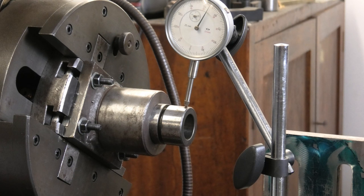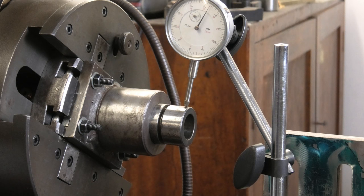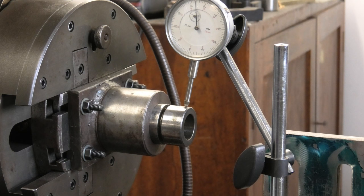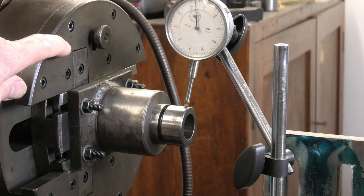Okay guys, this is round one — over and done with — and I have lost substantially. I can't find where it's out. Everything has to go one way: you can't change the two plates around, the slide can only go one way, the feed screw can only go one way, the snout bar holder is keyed only on one side. I've checked that the little drive dogs aren't jamming up in the drive slots, and there's no light between the mating surfaces. And this is what I've got. It's not out lengthwise in the slot — it's out that way. So I'm going back to first principles. After I get some food, I'll be clocking up the face of the facing head. And if that's not good, I'll take the plates off and clock up the chuck body. Maybe I haven't mounted it correctly on the shaft — I thought I did a pretty damn good job, but as you can see, just not good enough.